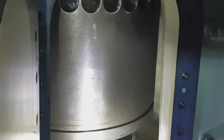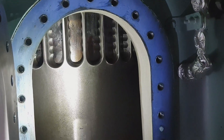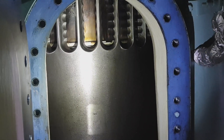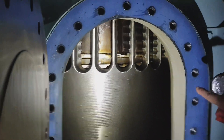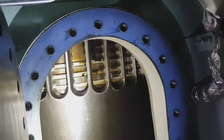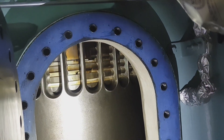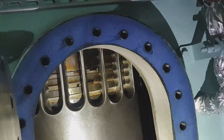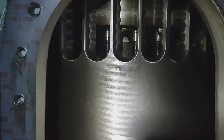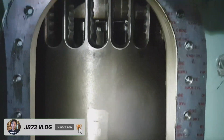The bottom line of this topic is why we are doing this kind of inspection. Experience has shown that unsatisfactory piston ring function is one of the main factors contributing to poor cylinder condition. For this reason, regular scavenging port observations are strongly recommended as a means of judging the ring condition.